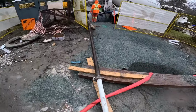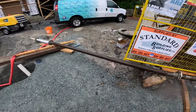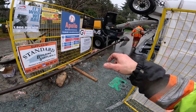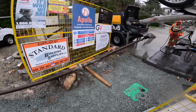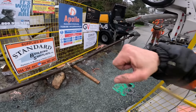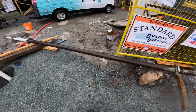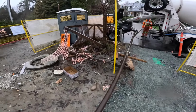Yeah, a couple pipes off the back end of the pump like this really, really stabilizes things. And we ratchet strap to our elbows and everything else. It's not the ideal setup. Normally we would weld hooks onto the hopper, run chains, but obviously with this temporary setup, we really can't. I might grab a cable and a come along and some hooks or something. We will get something better for that. But that's a pretty heavy ratchet strap, so it'll suffice for today.